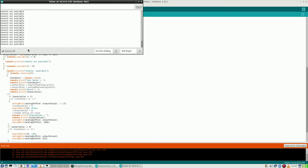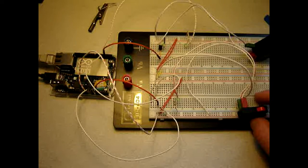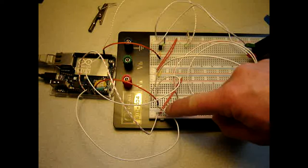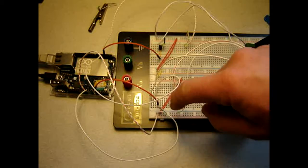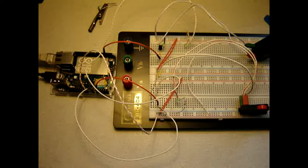And if I put some resistors in series, it will change, and in parallel it will change too. So now I have the 1023 value, which means either everything or nothing. So let's do that. That's interesting. And now I'm curious what will happen to the circuit. So at the moment this switch is no longer red. It is one resistor from the plus to whichever, then with the wire that previously was here is now to A0, which reads, as you could see on the serial monitor, 1023.